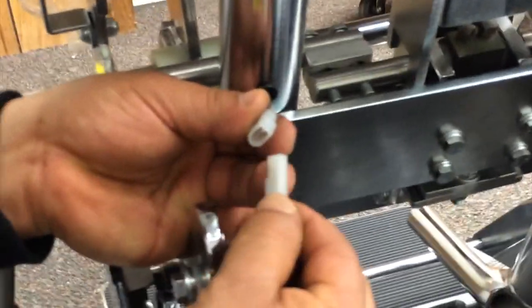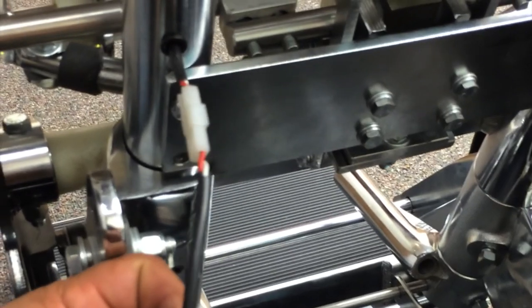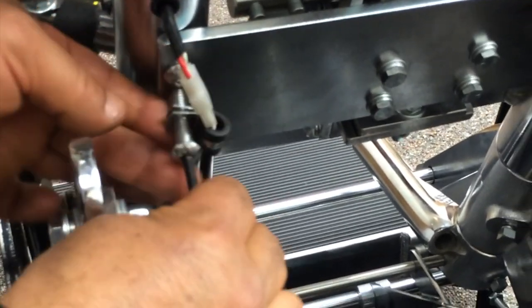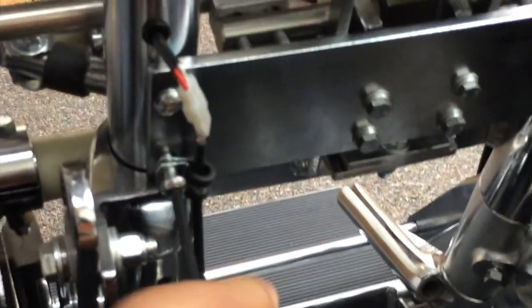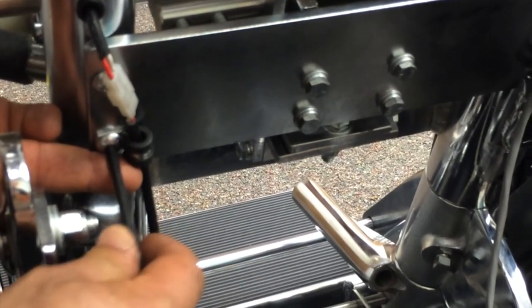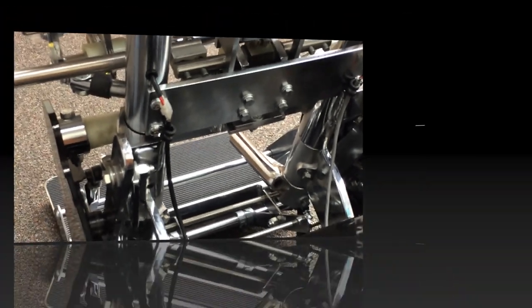We're going to go ahead and connect the power front harness into the respective Molex connector. We already have a clamp and bolt attached. We're going to take the locking nut, which is there for shipping purposes, and discard that. Using the Allen wrench that's provided, we're going to insert that into the hole on the right side of the table, underside of the pipe, and we're going to tighten that hand tight. And we're now hand tight. That completes the activity for connecting the power front harness and retaining that power front harness to the table.